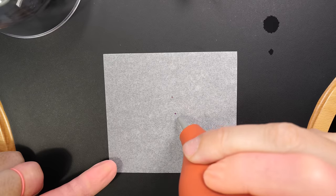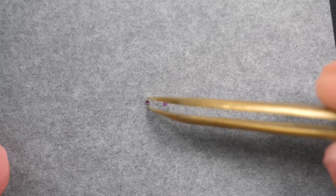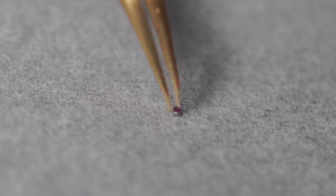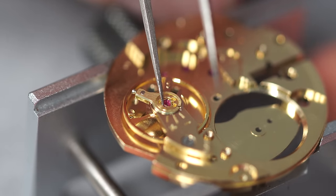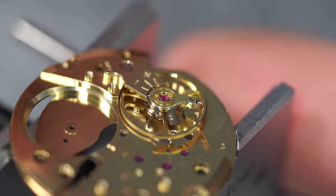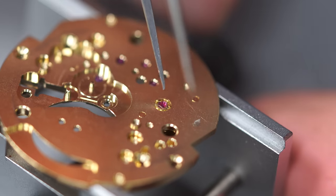When the epilam treatment is done, just drying the stone a little to remove any excess, then dropping a small amount of 9010 oil right in the middle — a tiny drop. That's very tricky. When it's done I can put the cap jewel back on top, back to its place right in the center over the balance staff. Closing the spring — I close one arm and then the second one using thin tweezers. That's it, in position.